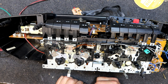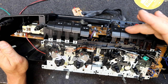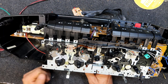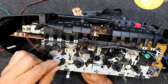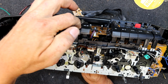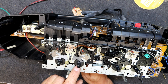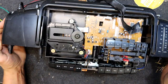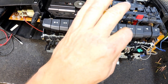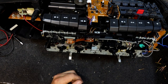That shouldn't be running like that. That should be in idle mode. Oh, so we've got an issue here. I get a feeling I've seen these decks do that before, but it wasn't doing it before. That doesn't seem to operate in fast forward. Surely that should. Jeez, that's a bit dodgy. Are they bypassed in? Oh, very weird. Yeah, that one's just started being a pain. Doesn't do it when it's in play mode and operates. Put in pause, it fixes it.